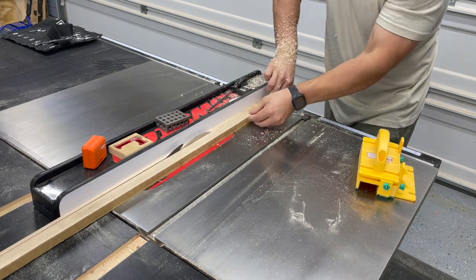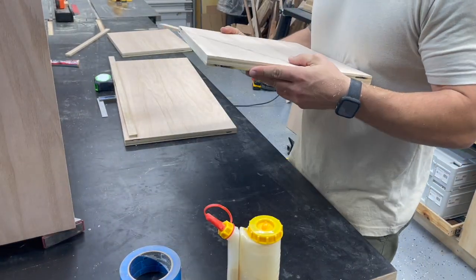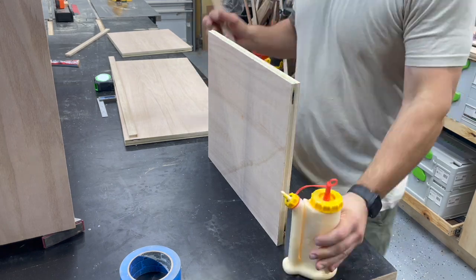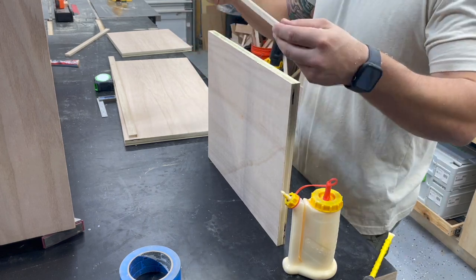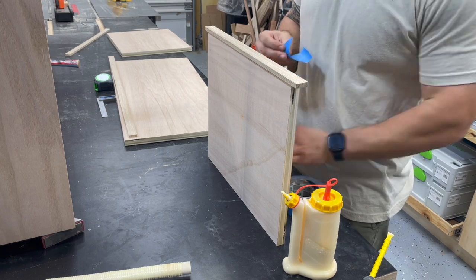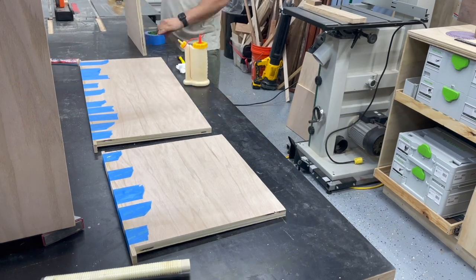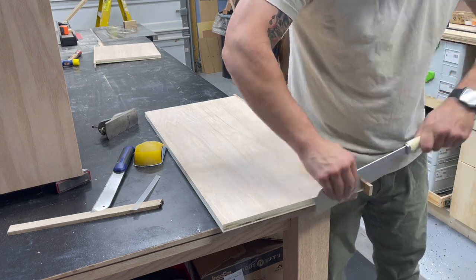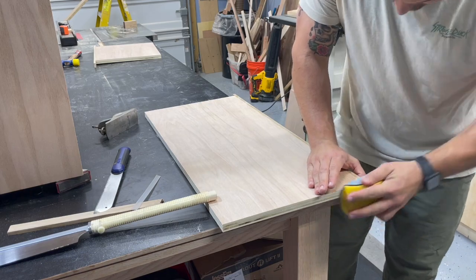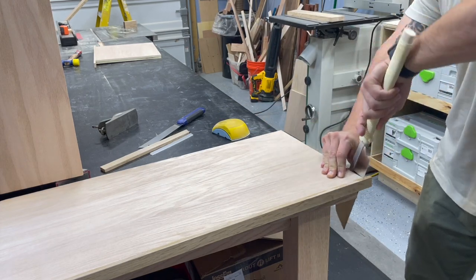To cover that front plywood edge, we're going to make some hardwood edge banding out of white oak over at the table saw. You can also use iron-on edge banding, but the advantage of using the hardwood is I don't have to mess with it as much and I know the color will match since it's the same white oak as the rest of the cabinet. Before putting the edge banding on, make sure the shelf is oriented the correct way. I left these strips a little bit wider than the shelf itself so there's overhang on both sides — makes it less stressful — and then I can clean it up with a flush trim bit on a router later. Once dry, I used a Japanese pull saw to lop off those ends and then cleaned up with a sanding block.